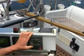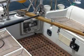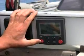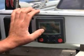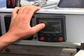Use plus 1 or minus 1 for fine-tuning port or starboard course adjustments. To come off self-steering, hit stand by, then lift the control arm off and resume hand steering. Auto helm steering and hand steering are mutually exclusive — either auto steer or hand steer, but not both at the same time, as doing so will lead to a broken autohelm. Hit auto when the control arm is on the tiller to engage; hit stand by and lift the control arm off to resume hand steering.